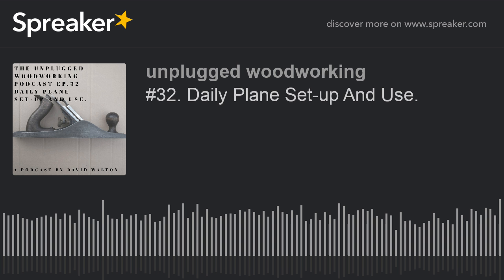So with chamfering and rounding over, I use my number 4. I use this all the time for chamfering and for rounding over. Again, I've done this for such a long time now, I don't think I'd really change it. I can do it pretty quickly. So if I'm rounding over, I'll put a chamfer on it first. Same again, I'll just skew the plane. On the edge of the board, I'll aim for 45 degrees, and then I'll skew me plane. But again, I'm not really sure of the angle.